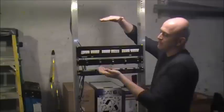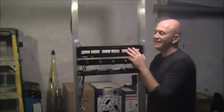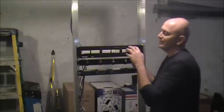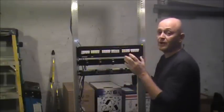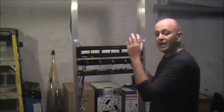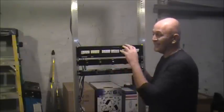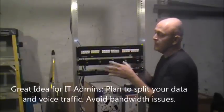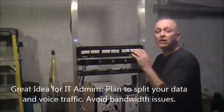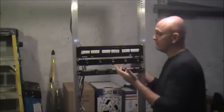Also, this video is for the new techs. We also tried to separate — a lot of times people were using voice over IP and doing away with analog. So one patch panel for the network, one for the VoIP — data and voice. We try to separate that because even if they're not utilizing it now, in the future it's a great thing to have, and you'll do it right the first time.